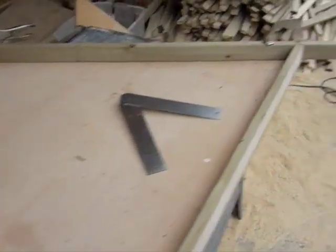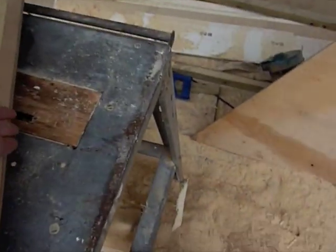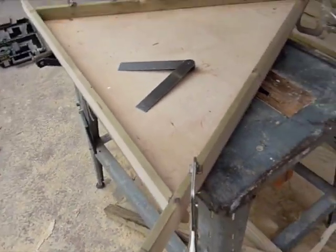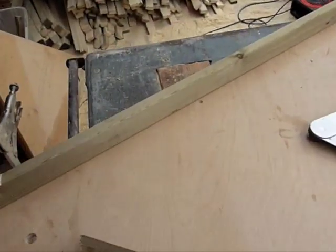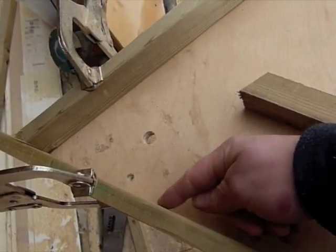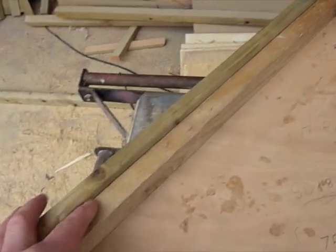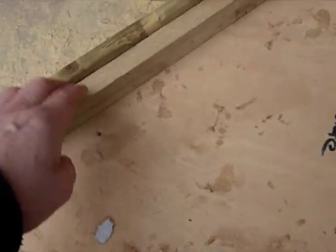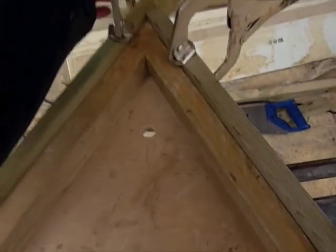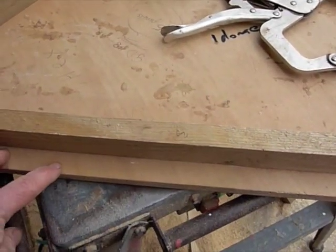I've clamped them in position now so they won't move. And that gives you the start of your pattern. Check everything all the way around to make sure that it's all completely flush with the outside of your pattern. Next, you need to fix a square section of timber like this to the inside touching here. Then you fix this to the pattern. Make sure that it fits nice and snugly all the way around the pattern. And that's all fixed to there, so now we can take this off. We're left with a square section fitted onto our pattern. That makes the jig.